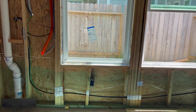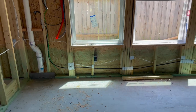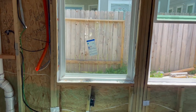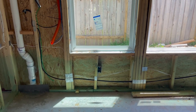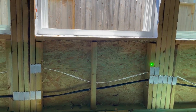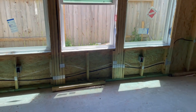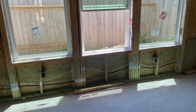The next find is a little small, but you can see that the outlet is crooked and it would be pretty hard to adjust it once the sheetrock goes in. We're going to recommend straightening this two-by-four so you get a straight outlet. Underneath the window, you can see there are some gaps in between the framing — sometimes this can cause settling or cracking — so we're going to recommend to shim right underneath this window.